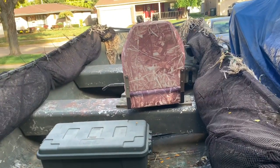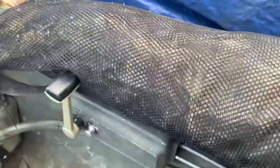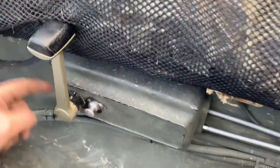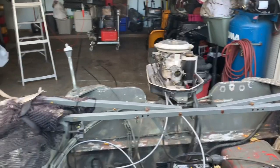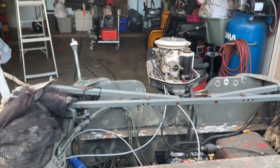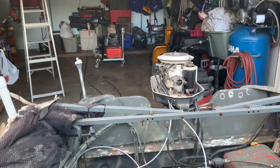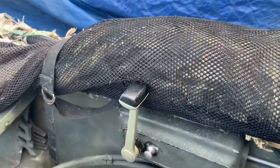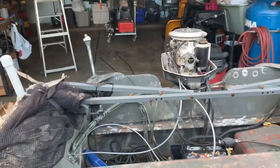When I get the impeller that might be tomorrow, but just to wrap up: the shift control box is now in neutral — you can see the new indicator for neutral. When I throw it forward, it only goes so far on the accelerator. You can see it moving just slightly as I engage it — it's in the neutral position so it's not going to over-rev the engine. When I put it back in neutral and push in the button, now I can advance it to full throttle all the way.